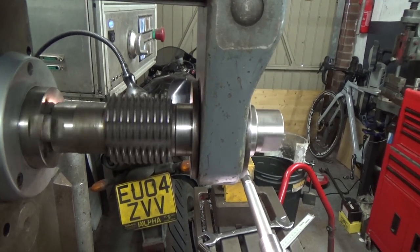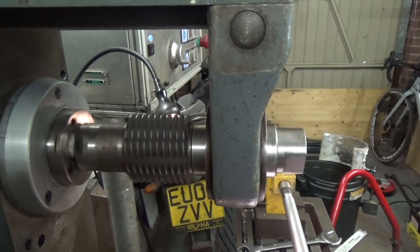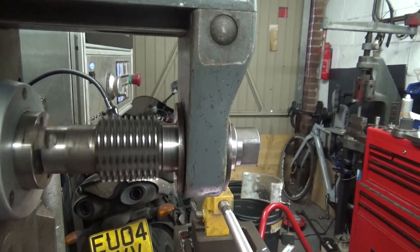If you squint along the teeth of the hob, you can see that the screw thread is running right to left, and that the groove between the teeth is angled to the left on top and to the right at the bottom, where the cutting happens.